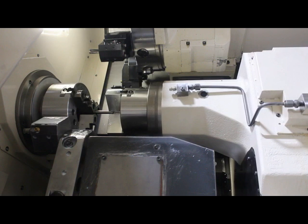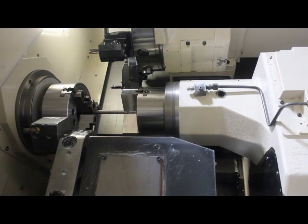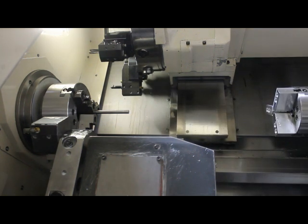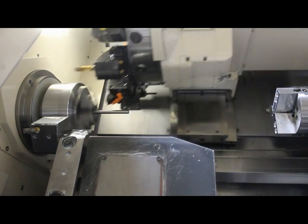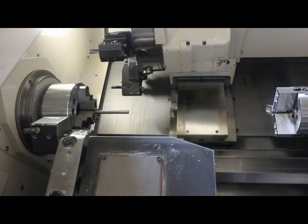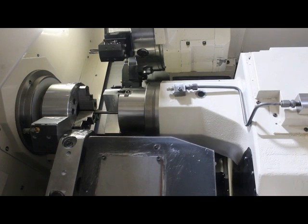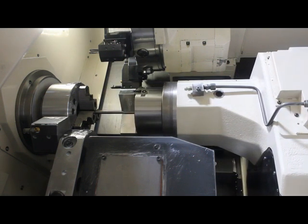In order for the tool to clear both chucks, I have to pull cut the first few grooves unsupported. Once we get a few grooves in there, we'll go ahead and support it. This part could be optimized and sped up a little bit — I do it later in the program, but just to test this was going a little slow.